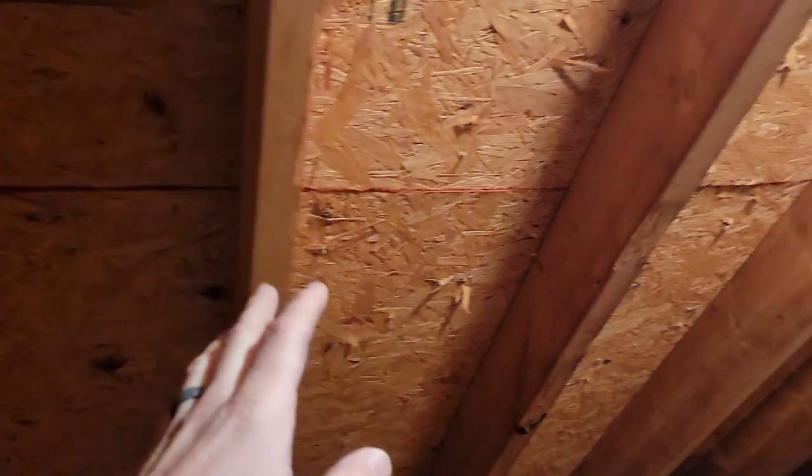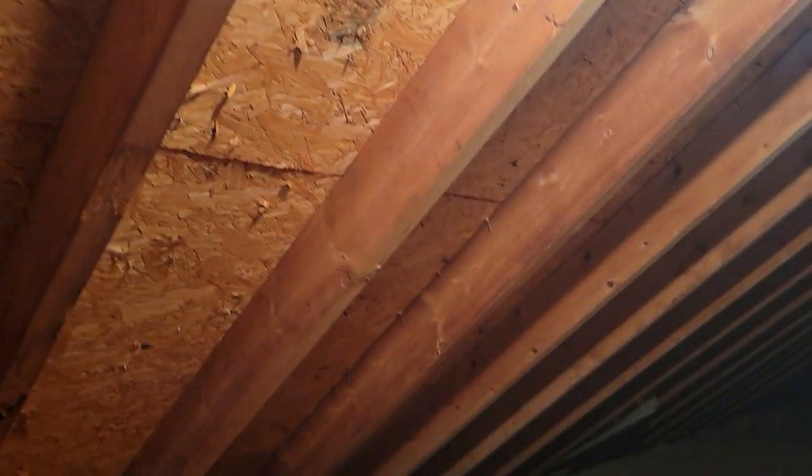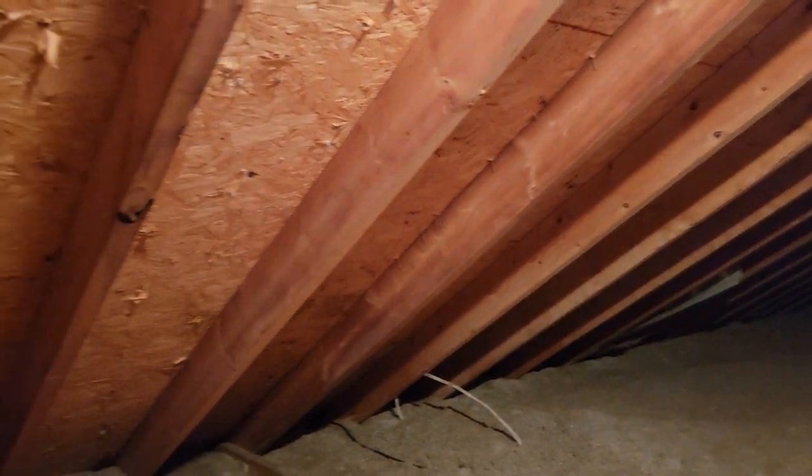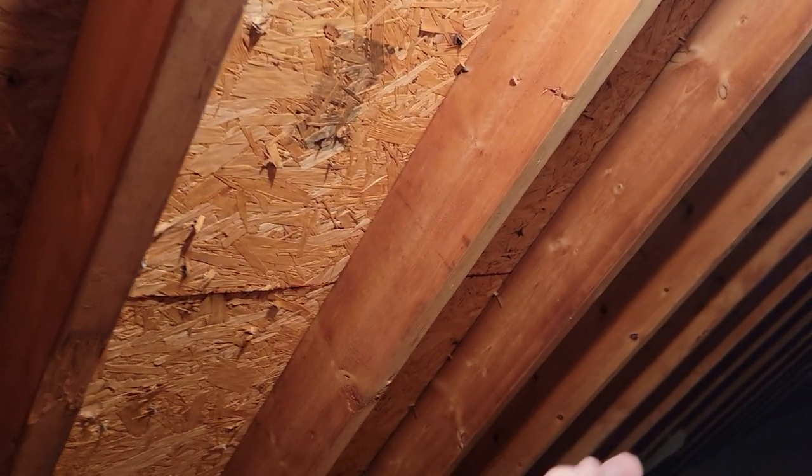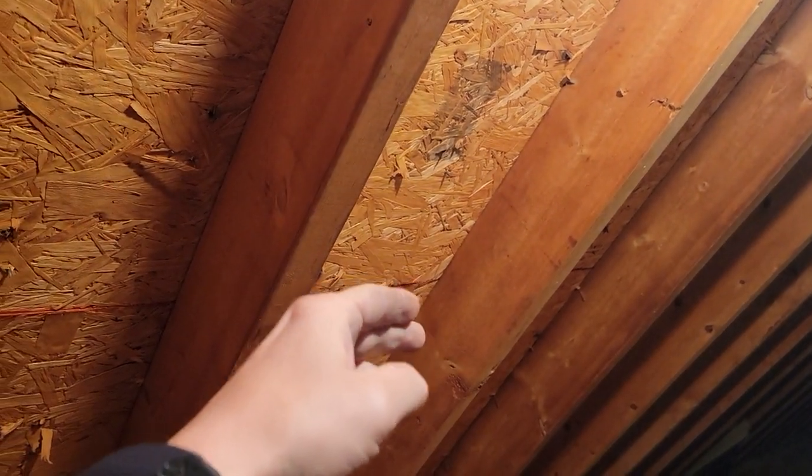If you are redecking a house at current decking prices I'd rip everything off, but if you strip it down and see one sheet buckling really bad but the wood is otherwise good, you can put a skill saw to just the right depth and rip a channel through it to create an expansion channel. But that's why you want to use h-clips from the start.